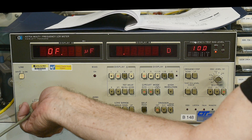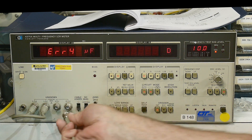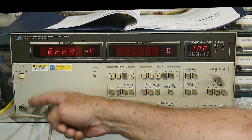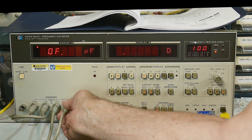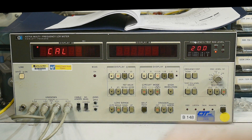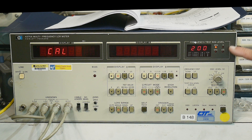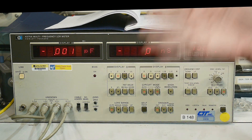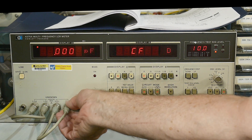I'm going to do what the manual says - put one BNC over here and one BNC over here. These BNCs are not floating; they're all shorted together on a piece of metal, so it's not the ground - it must be the shielding. When I put shielded wires from each one and hit open, it cals correctly. What it does is run through all the different frequencies doing an open calculation at each one, but it doesn't work without shielding.